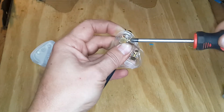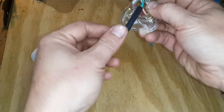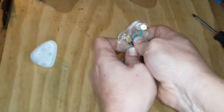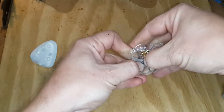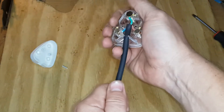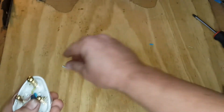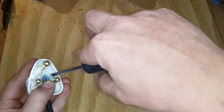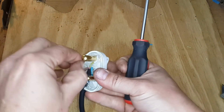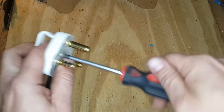At the bottom of the plug are two little plastic wings — sometimes removable, sometimes not. The idea is you push the wire in firmly between them. Twist it firmly in and make sure all the pins are firmly in their place; this prevents the cord from being pulled out of the plug during use. Then simply replace the cap and put the two screws back in. It's that simple — almost anyone can do it with a fair amount of basic tools.